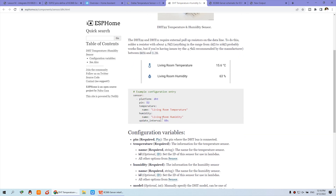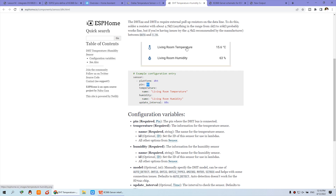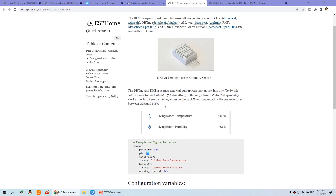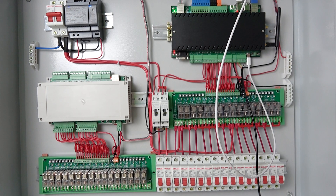The code for DHT11 or DHT22 is also very easy — just copy and paste and change the pin. Temperature and humidity use just one pin, GPIO 4 in my setup. This is how to integrate the temperature sensor with the ESP32 on the server. Thanks for watching.